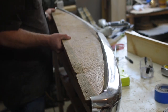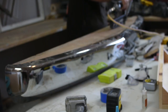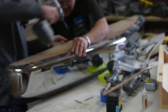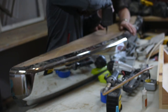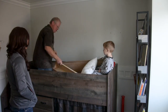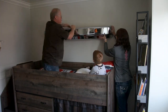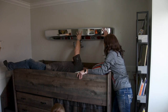Next, Dave put the cut shelf onto the top of the bumper and made sure it still fit properly. We used a nail gun and then three screws to attach the wood to the 2x4 underneath. This bumper is very heavy, so it was important that we found the studs and got it level the first time. Then we placed the bumper on the bottom cleat and made sure it was centered and snug.